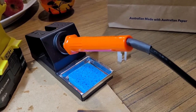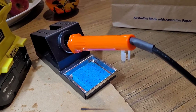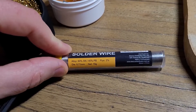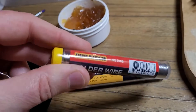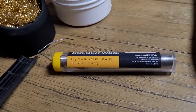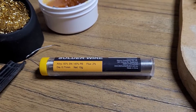I bought a solid 40-watt soldering iron, about $20 to $30, a good mid-range iron. I also got some good advice. I was using lead-based solder — 60% SN and 40% PB, which is lead. I had a couple of these and they were both lead-based. What I found out is that lead-based solder has a lower melting point than non-lead-based solder.